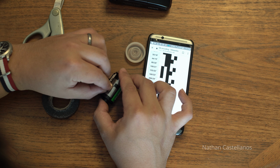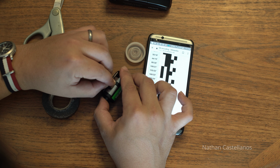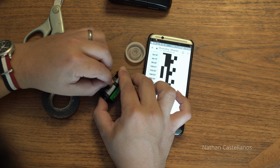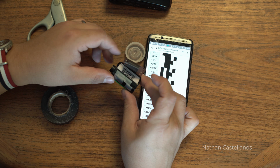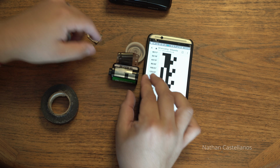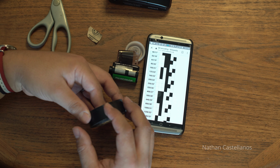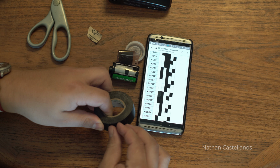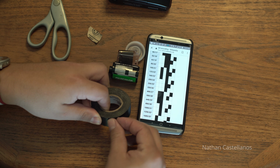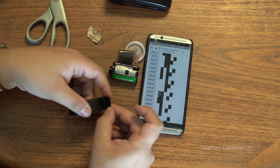Removing is as simple as taking off that non-conductive layer of paint that's over the aluminum. So I just took a small piece of sandpaper and went at it. Once you've got those contact areas clean, get out your tape. You need to cut a piece of tape that is the same size as the columns, because for the 400 to 200 shift, you're only going to be covering up a single column.